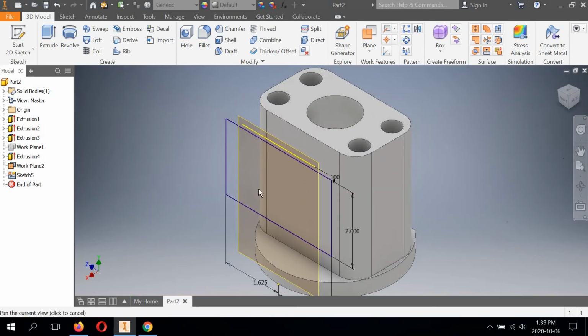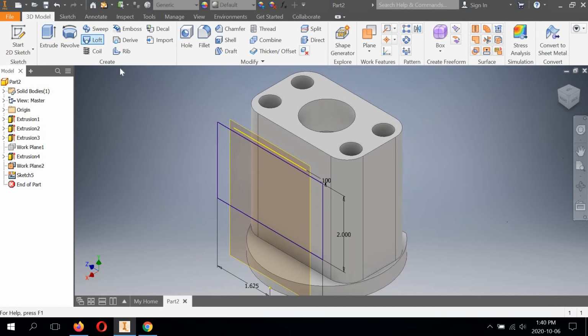Now, at this stage, I would not extrude this quite yet. There are fillets here, like I did here. This may cause a modeling error trying to add the fillets after it's extruded. So you could try it, but I have a feeling it might give you a modeling error. And we get into the harder parts. If you're doing things in a funny way, Inventor doesn't like it, it will give you modeling errors. So we're trying to avoid that. Everything I've done so far has been perfect. So I'm going to